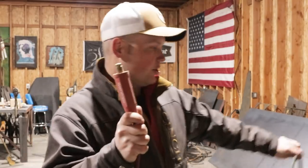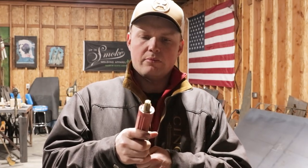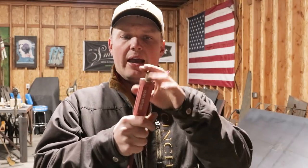Now, as far as your heavy hitters go, and a few different other ones, they give you a quick connect. I don't mind the quick connect, but I don't love the quick connect. I would much rather have a block, because I don't want to run quick connects on my leads. Basically, that's really what it boils down to. I do run quick connects on my stinger side, because every now and then I'll run a suitcase, like a wire feed suitcase, my Miller 12VS Extremes. I got two of them in the trailer, just in case we have to run some wire on a job. I got the ability to just hook into it and ready to rock and roll. I can swap my leads on my machine if I need to, and hook into it that way, but like I said, I prefer the block.